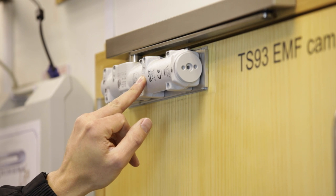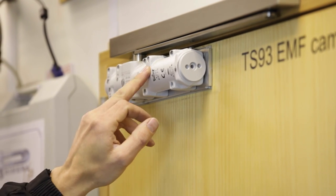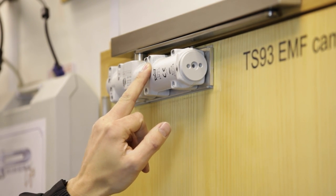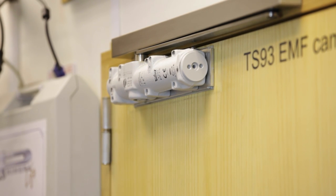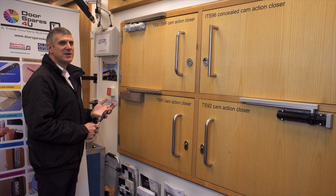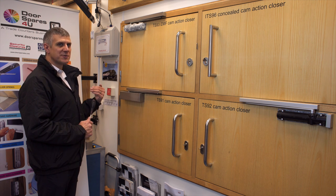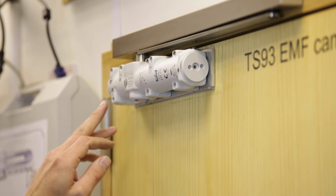On this TS 93 model we have an additional two valves. Valve 3 is the back check function, and if we screw the valve in clockwise we'll increase the resistance when opening the door. So if the door is opened violently, either by the wind or someone flinging it open, it will help slow the door down so it doesn't damage the wall behind it.